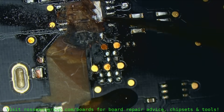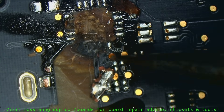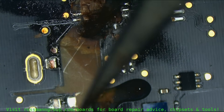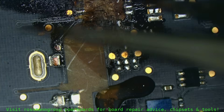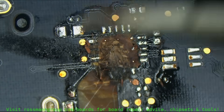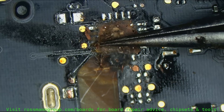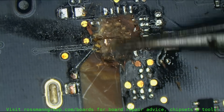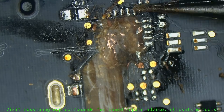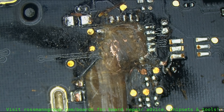Now we're just going to rip off the center pad, which is mostly ground, and I want to see if the center pad is merged with any power pads, and try to rip it apart without merging them together. You can't spell repeal without peel, so let's peel these layers off. That's a job for the Dremel. Make sure that nothing is touching.